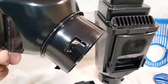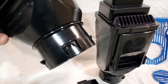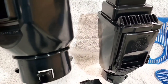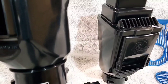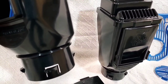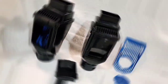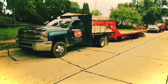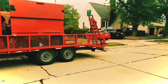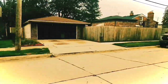This will fit inside Schedule 40, Schedule 35, Schedule 30 PVC, and triple wall, which is septic field pipe. This will snap down in the corrugated. This fits inside anything 4-inch, and we have a reducer that will take it to 3-inch. If you like the Made in USA products that we're bringing to the market, give us a thumbs up — it supports what we're doing. If you have any additional questions regarding this vented clean-out leaf filter, leave them in the comments section.